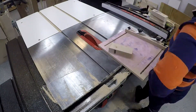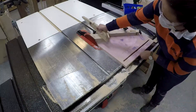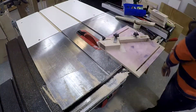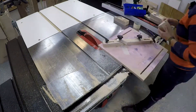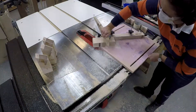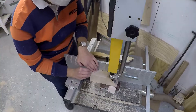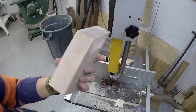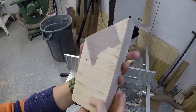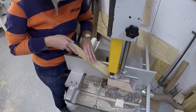I'm cleaning up each edge to make sure all pieces have the same dimension. The last thing to do is cut out the nice angle of the trophy using a special jig, adjusting it to the exact angle I need along that edge, and clamping down the piece before running it through the table saw. Then I'll cut the back off each trophy so you can see a clear epoxy cast all the way through.